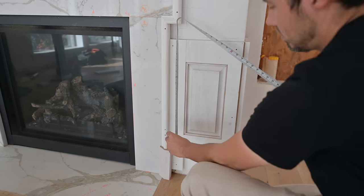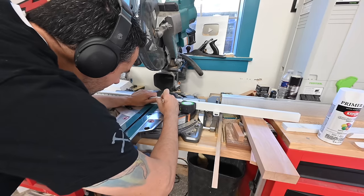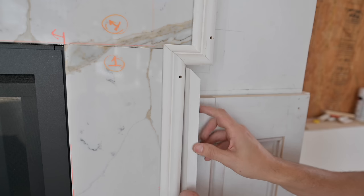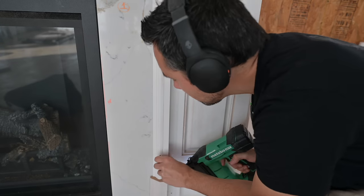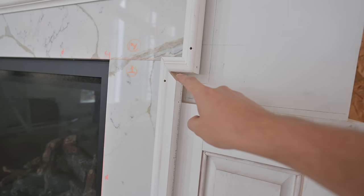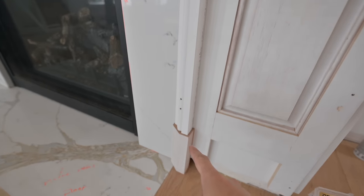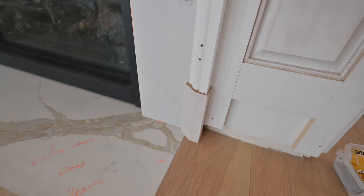But first we've got to get our backband on our little stone casing — the one that's running around our stone. We have our backband in place on our Wainscoting unit now. I'm not going to run it around the whole cross-seated corner mantle detail right now because I need to leave it off so whenever I build the over-mantle up. But I do need this in place so I can go ahead and install our plinth block. We'll go ahead and plumb that up and attach it with trim head screws.